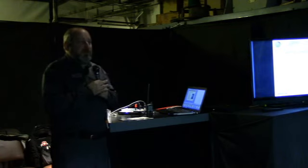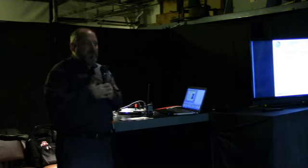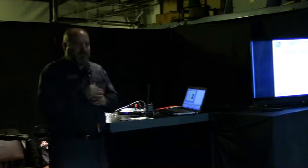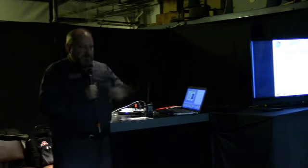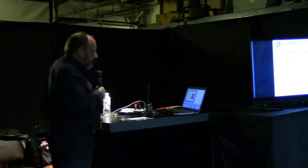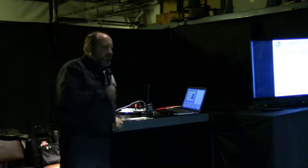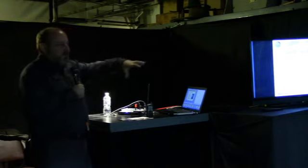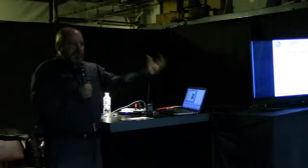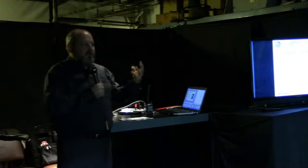And you have all that functionality, except now you can still do voice and data, which before with FM you would have only had a voice repeater. With this, I still have some other functionality. I still get my location data. I could still transfer text messages. I can do all of that stuff through a repeater that I can't do with an FM machine. If you do have internet connectivity, then you can do all kinds of interesting linking capabilities over long distances. You can use these reflectors that don't have to be located anywhere near where you are. They could physically be anywhere.